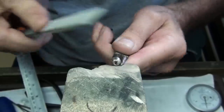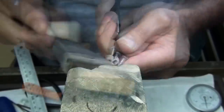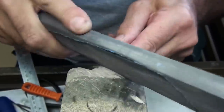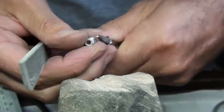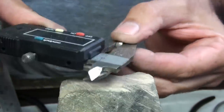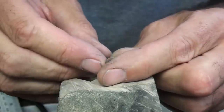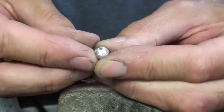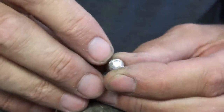Your setting will no doubt have some dents and scratches, so file those off and check the form of the setting — make sure it's equally tapered all around. If it's not, it means you've struck the setting slightly off-angle in the block, so more practice is required. Get rid of tool damage, then file marks using 400 grit emery paper. File the top of the setting perfectly flat and check that the bottom is parallel to the top — confirm with your vernier gauge. The stone should sit on top of the setting, covering around about a third of the thickness of the metal.